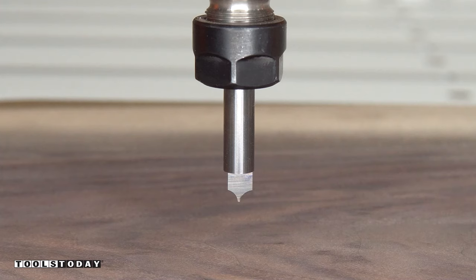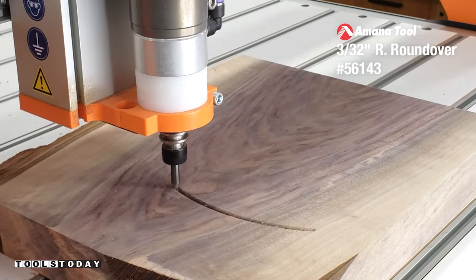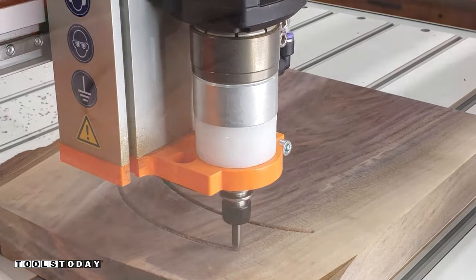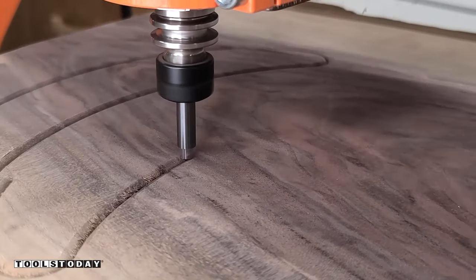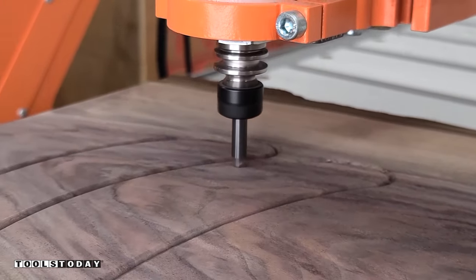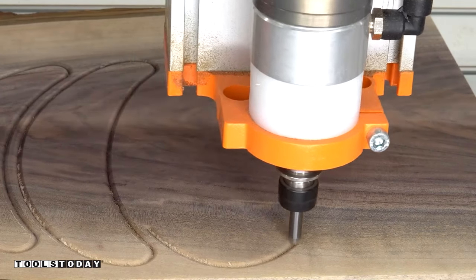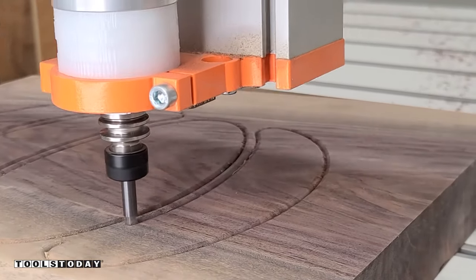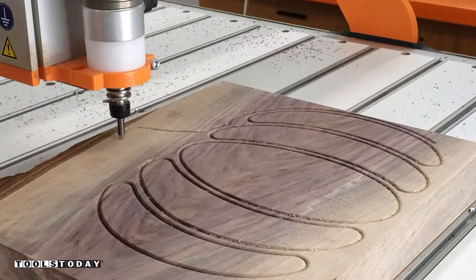I'm picking up the 46143 3/32-inch radius point round over bit. We're just going to use this to add a round over over the entire profile on the inside and outside of the tray. It's going through here in a single pass and does a really nice job. It's definitely easier to do on the CNC with all of these smaller pieces without a whole lot of support on the material. We went through the entire profile on the inside, leaving perfectly clean cuts throughout the project even though most of this is going across the grain on walnut, which is definitely not easy to do while leaving a chip-out-free cut.